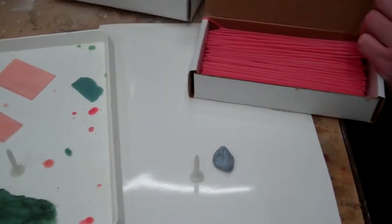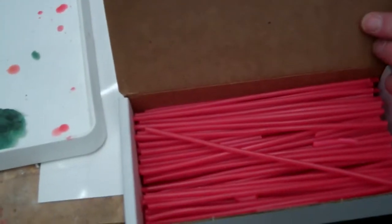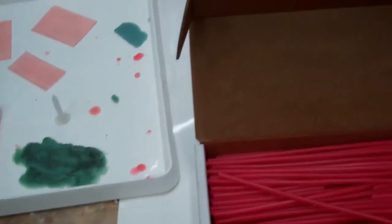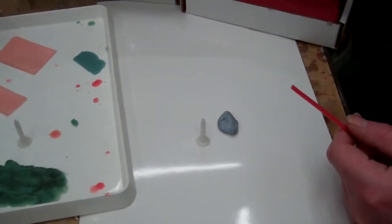There are lots of different sizes of sprue wax. You don't want to put a massive sprue onto a tiny little model — you can put little delicate sprues onto smaller objects. The function of it is just to make sure that the metal will flow to all parts of your model.